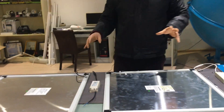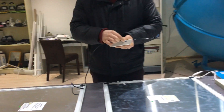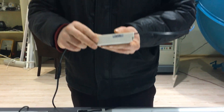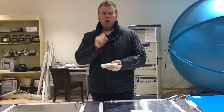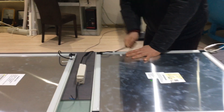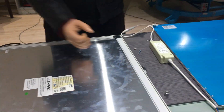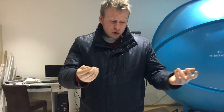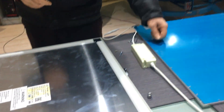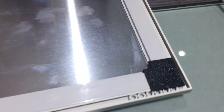Now I come on to our panels. The driver is fully TUV-GS approved — it's barcoded. We can scan this barcode and it will tell us the day of manufacture, the exact components placed on that day, who QC'd it, who checked it — everything. We look at the strain relief: you cannot yank these cables out of the corner. If you want to put in a suspended drop ceiling, you should have one cable tied up to the ceiling. We have a nice little part you just put onto the runner rail, then screw down and lock in. Nice and easy — takes less than a minute.